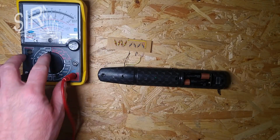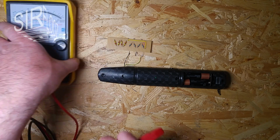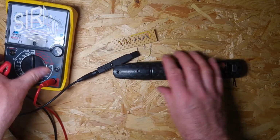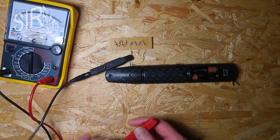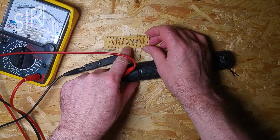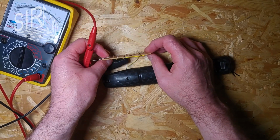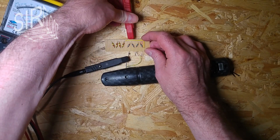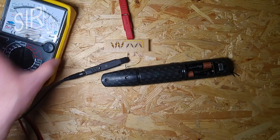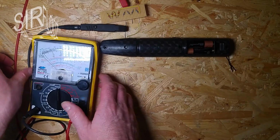So I can now make a first test, and for this I want to use this analog multimeter. I've set it to the 1000 volt range, and then I have to connect it ground to ground. That's good. Basically I want to measure the voltage above one resistor here, not to overload my multimeter, and that's then here. See, is that true? Yeah, that's true. Okay. So let me arrange that so you can see what's going on.